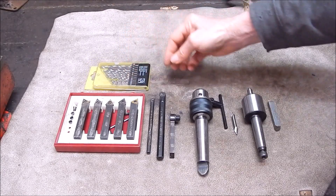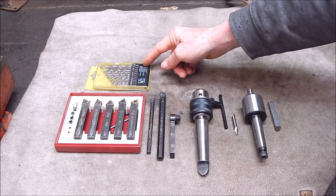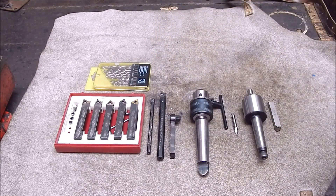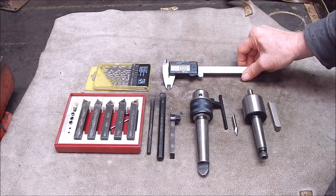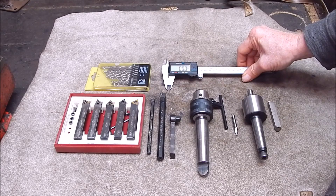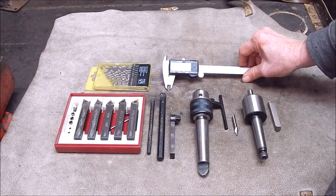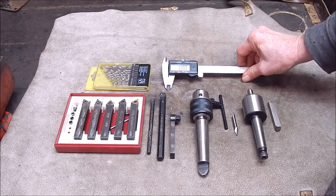You need a set of drills so you can use your boring bar — you must be able to drill a hole in the end of the job to then insert the boring bar. Ideally your drill set would go to larger sizes. You also need an accurate measuring device that measures internal and external dimensions. Even a cheap digital caliper is plenty accurate enough for home handyman work. The alternative is an analog vernier caliper, which some people still use — totally accurate and reliable because there's no battery to go flat.